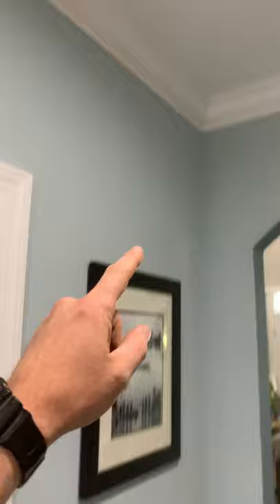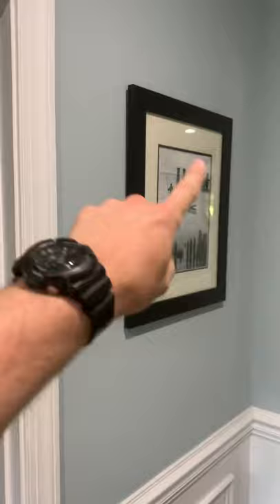After you get to the sconce from the switch, you could drill through a stud this way and put a hole here. You should be able to catch that wire, get up to the sconce light, and then I would cut a notch out of the ceiling. Drill down, fish up for your sconce, and then either you can take apart this recess light and see if you can get your sconce on the other side.